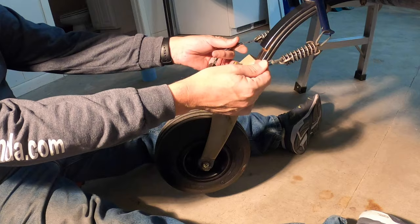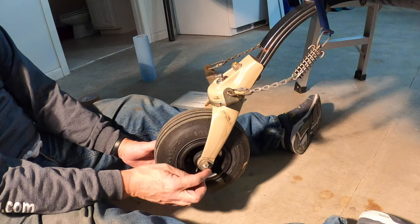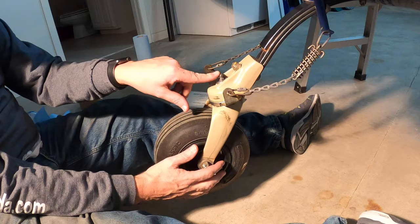With the Husky here I've tried loose and tight, and I like it a little tighter. The clutch has a little bit of play in it but not too much. What we're going to do is pull this off, check all the bushings, pull the cotter pin out down here, tighten it up, re-grease it, and do a little test on it.